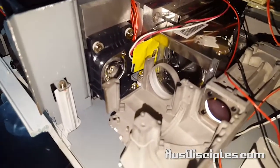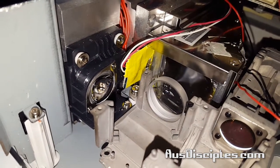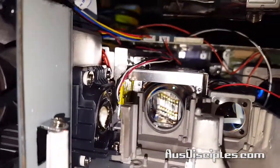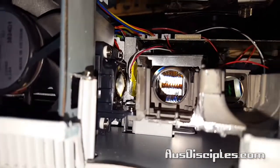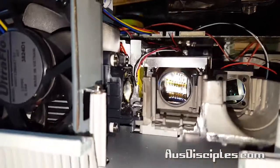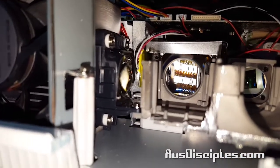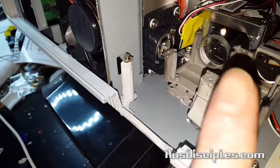What we have here is the optical side of my 60 watt 445 nanometer laser. That's what we call a Jacob's ladder — a bunch of mirrors in there directing 24, in three rows of eight, 445 nanometer two-and-a-half watt laser diodes to a single point.